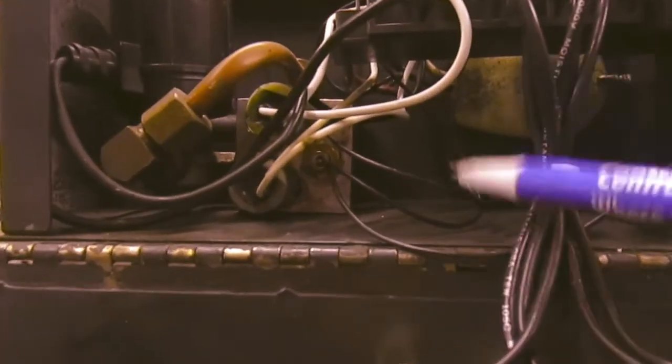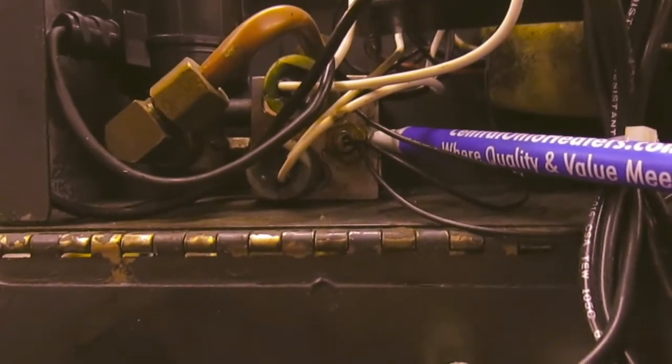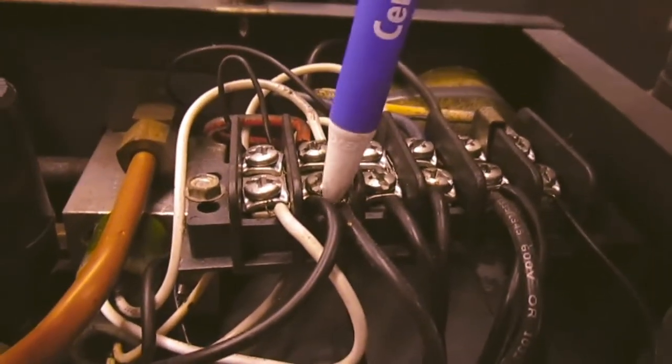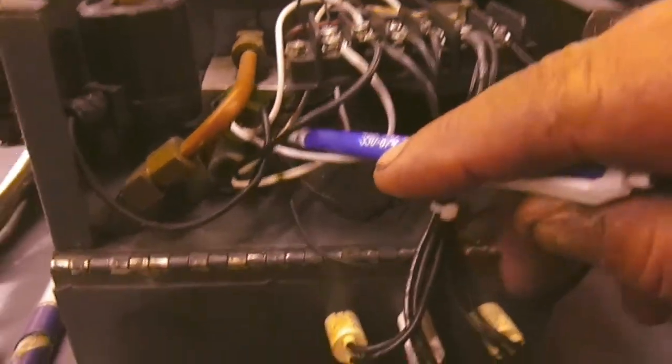This Shenandoah here has a big 300 watt heater right here. It screws in with a 7/16 socket — it's about 10 inches long and has two wires on it. If the wires get burned off up here where they hook on, they get burned off right here. That's probably because this preheater is shorted out — dead short.